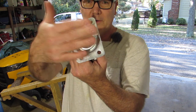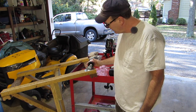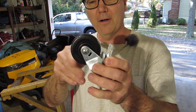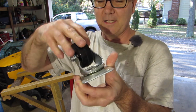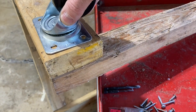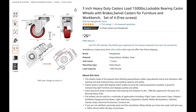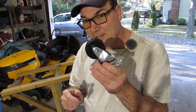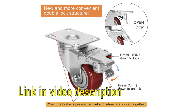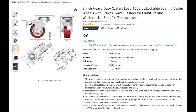The types of wheels you want are ones with a flat base, because that flat base matches up with the bottom of your two-by-four. These ones here are about two and a half inches, rotate 360 degrees, non-locking, probably polyurethane, with a steel base that screws in. I got these at my local hardware store, but after buying them I found that Amazon has nicer sets for less money - bigger, more heavy-duty, double-locking on each wheel with a foot mechanism. I have a link to those in the video description.